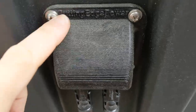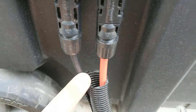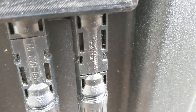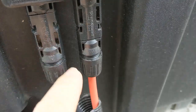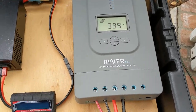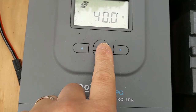Intake on this side. I got this on Amazon — it's a gland input so my two solar cables come in here. It's two connectors, so it's not waterproof because the plugs sit out. I'm just going to cut two of these plugs and seal it. That way it stays covered, and it is under the top here so when rain comes down it will cover it. And then I have this plug going out to the solar panel, so I'm receiving power from the solar panels right now.